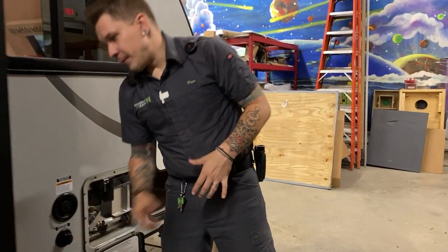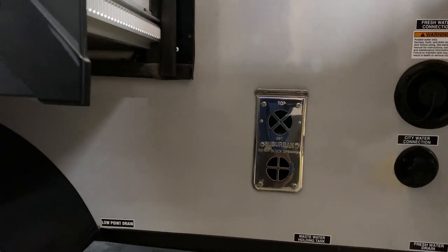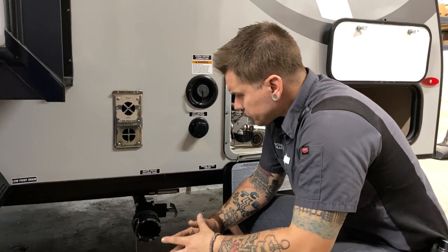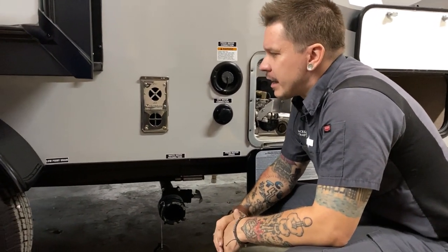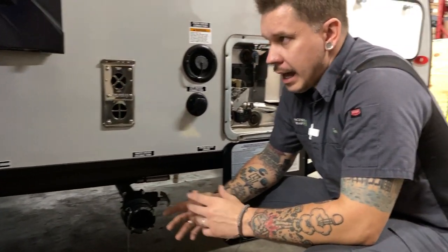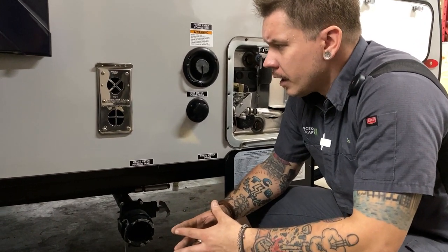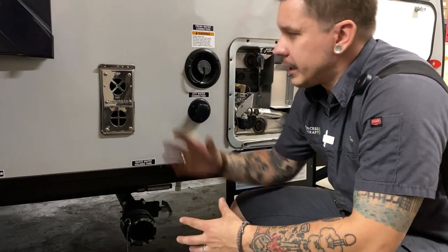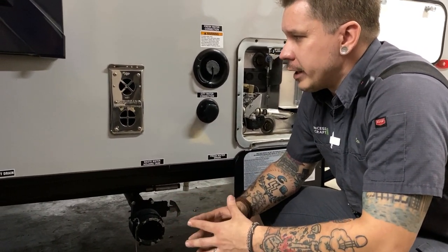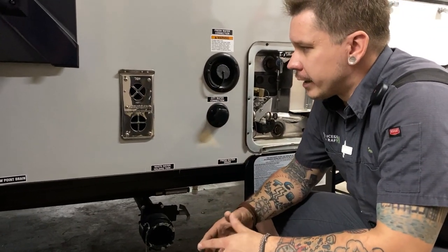We have your Suburban furnace here — a propane burning furnace with 12-volt ignition, not really a customer serviceable unit. It is very important to protect it from mud daubers and flying insects. What you see here is the exhaust for the appliance — it is very important that we let it breathe. Keep this free flowing, make sure you're not restricting that flow. It blows very hot air when on, so don't place a lawn chair in front of it — just make sure it is unobstructed and free breathing.